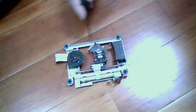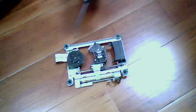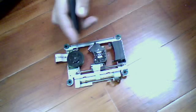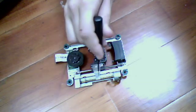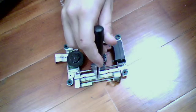You also might want to clean the tracks for the worm gear, and these tracks and these rails. After that, you might want to take a cotton swab or something and wipe oil on the rail, this rail, and the worm gear. You also might want to unscrew this, check it, and if it's at all dirty, clean it with a cotton swab or something.